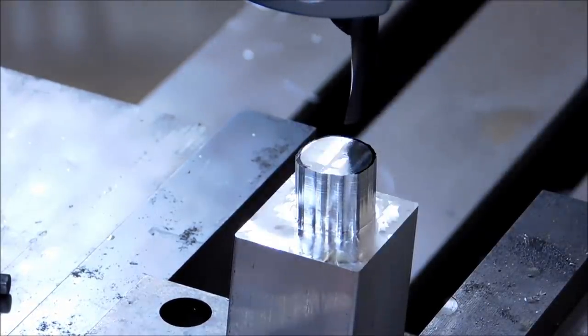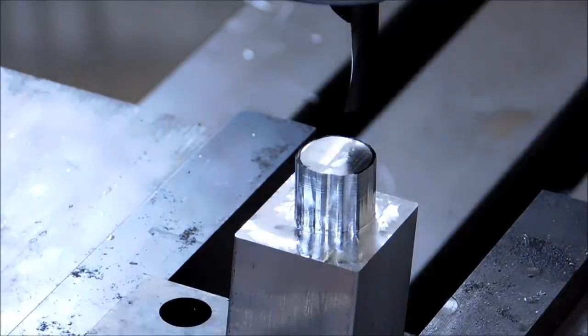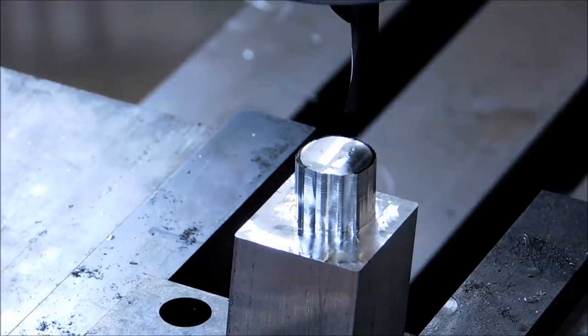Okay, let's get back in gear. A little bit of snug on the quill so it doesn't have a tendency to dig, jump around, reject, bounce, whatever you call it where you're from. And make sure that you turn the machine on in the correct rotation. With the tool flipped around like that, you may actually have to put the machine in reverse, which is what I'm going to have to do.